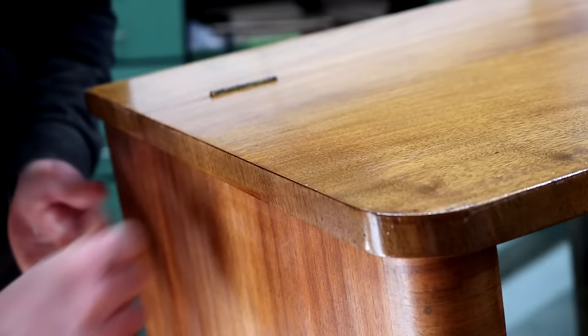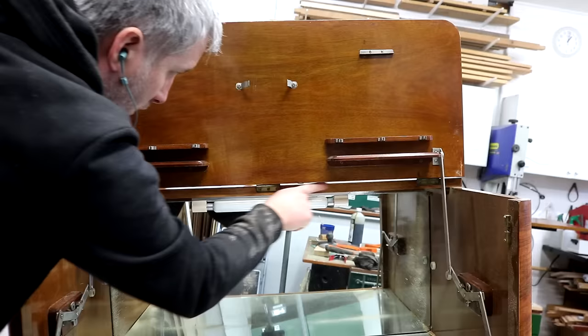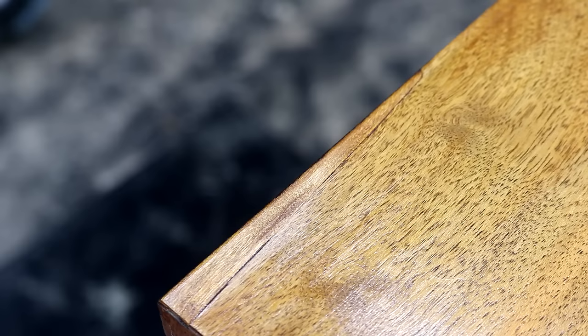I'm always careful to make sure I catch any drips. I love water-based varnish because it's so easy to work with, it dries quickly, it's hard wearing and it makes for easy clean up of the paint brushes too. And as long as you use a good quality brush and denib in between coats you don't really get brush strokes either.